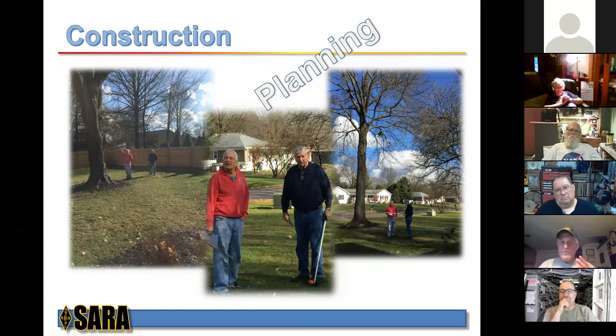So it's just a matter of doing a little bit of planning, walking your path, seeing how big of a loop you can actually put up. And again, what you want to do is put up as much wire as you can, as high as you can, to enclose the maximum area that you can. So that's how that works.